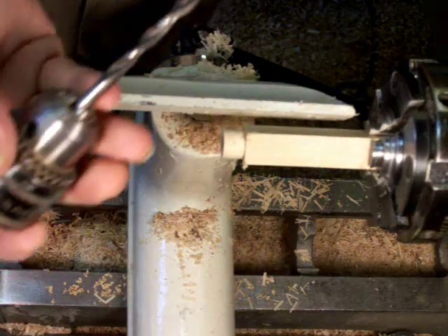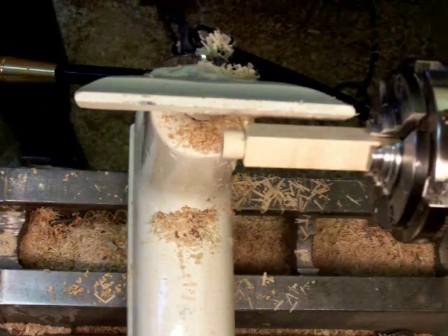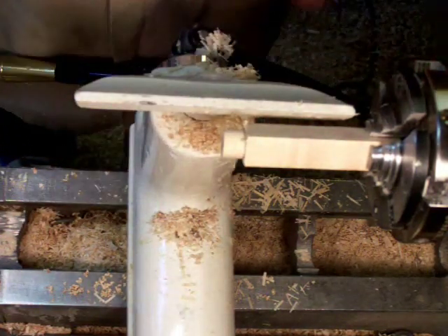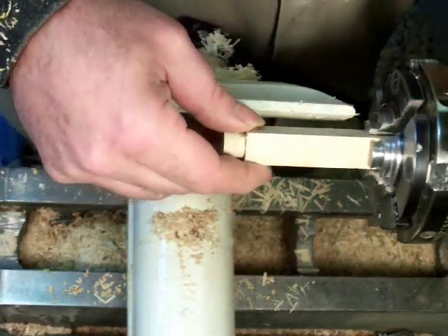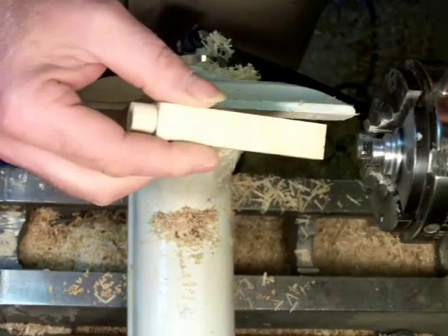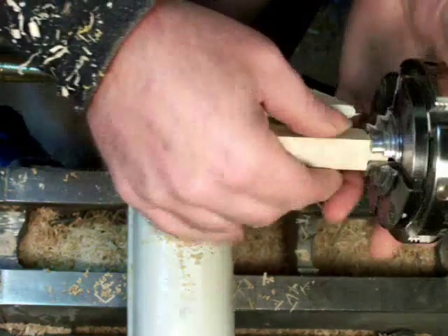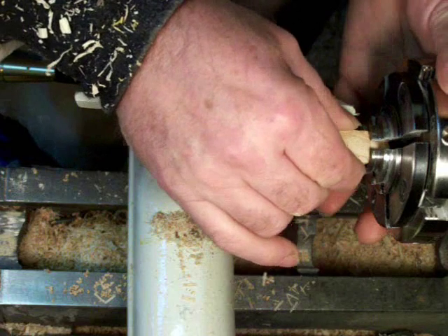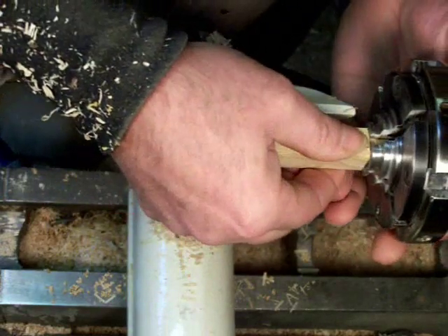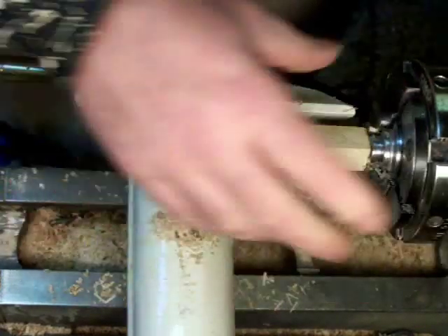I'll take that out of the tailstock, because I don't want that sharp end sticking out and back into it when I'm not paying attention. So basically, I'm now ready to turn it around. Now, if the tenon shoulders are nice and square and I've got them up tight to the front face of the chuck jaws, it should be running pretty true when I turn it around. At this point, a little bit of out-of-trueness won't matter that much, because I haven't even turned that section round yet.